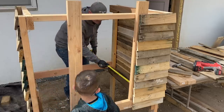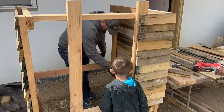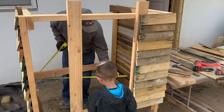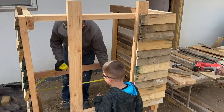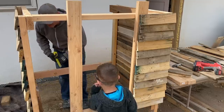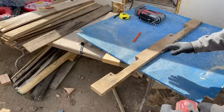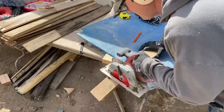Remember, 37 inches — and that's 37 inches. We built it square, it's 37 inches on both sides. It needs to be 43 and a half inches long, so 37 by 43 and a half. We'll make little cutout notches right here so it sits in there nice and flush. I'm trying to use up as much scrap as I can from the pallets — this is just one of the support braces.